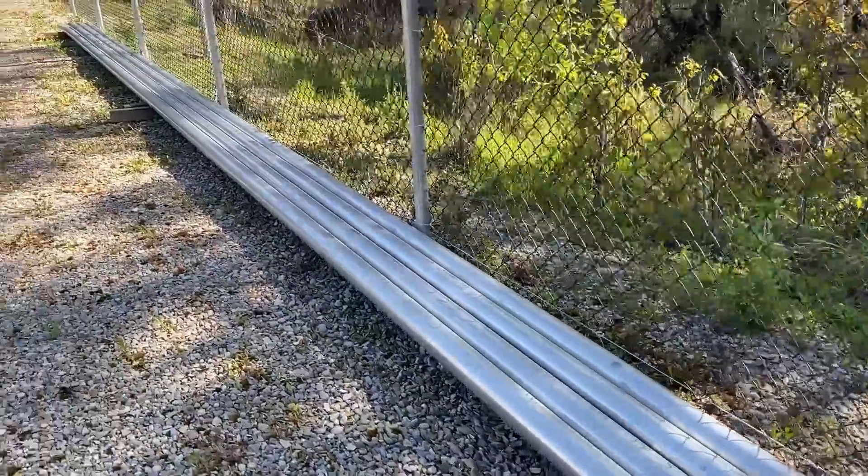The vertical has three guy ropes at three levels: 70 feet, 47 feet, and 24 feet. The guy attachments are made with a combination of worm gear clamps. I considered using 5-inch-long eye-bolts, but that would require drilling 6 holes through the tubing at each level, so I decided to avoid that.